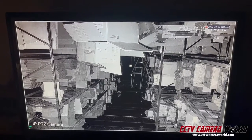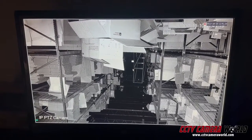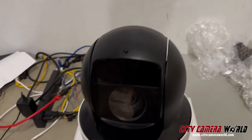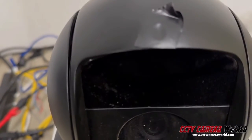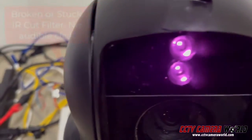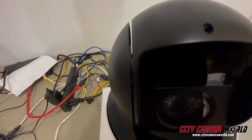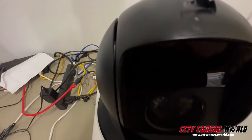I'm going to show you what a non-working IR cut filter on a PTZ looks like, and you'll see what happens when your IR cut filter doesn't work. Coming back to the camera that I started the video with, I have it here and I'm going to show you how its IR cut filter performs. I'm going to do the same test — put some tape on the top and let's listen quietly. You don't hear any audible clicks when that IR comes on. And then I'm going to remove the tape — let's see when the IR goes away, does the click happen or not? Nothing at all.